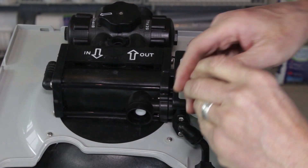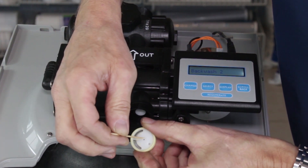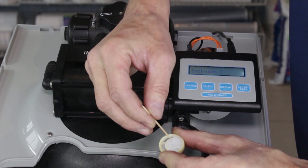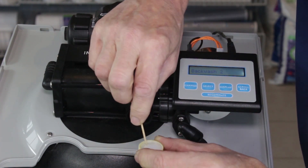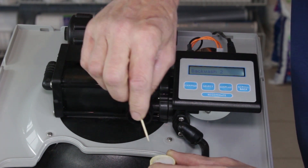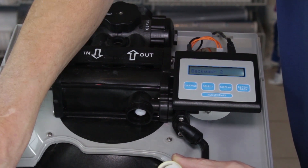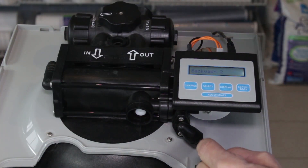When you pull out the injector nozzle, you'll see there's a hole in the middle. Just make sure you can insert a wooden toothpick inside to clean that out. Don't use a paper clip, a metal paper clip, or any kind of metal drill or anything like that, because you may change the size of that hole or elongate it. Once we've cleaned that, set it aside.